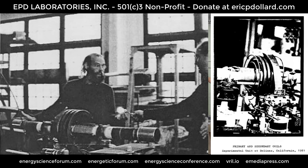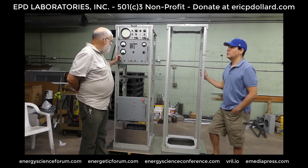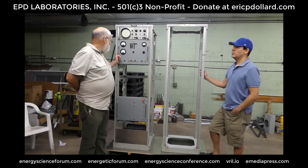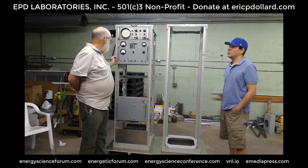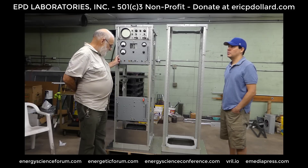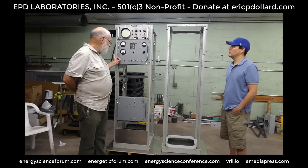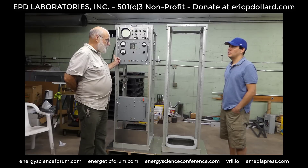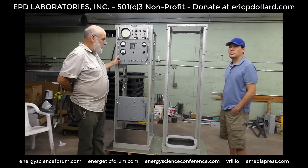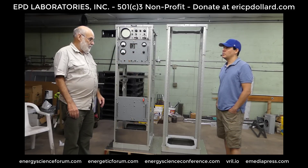It's going to look a little different than the ones I've normally designed, because this is a spark generator and more of a theatrical device in this case. Once this is developed, it will be operating at a frequency of about 3,300 kilocycles. Then I have a 5,000-watt completely constructed AM broadcast transmitter in the shop in Tonopah, Nevada, and the whole thing will be scaled up five times. At that point, it's anyone's guess as to how stunning the output is going to be. This is kind of the first stage — once the geometry is established, we go up to the big one.